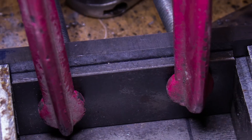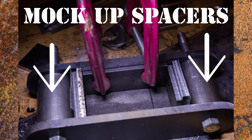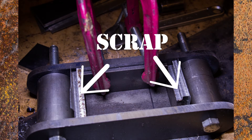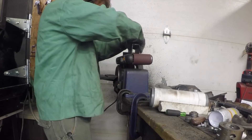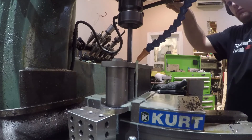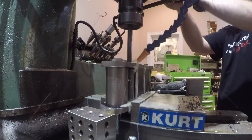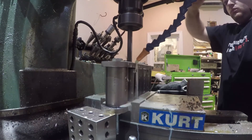I place the shackle sides on the mock-up spacer and bolt them together. I then place the sides of the spacer in between the shackle sides using clamps to hold them in place. I then jam some scrap steel into the ends of the spacer to align it to the center of the shackle. I then tack and weld the spacer together and grind the weld smooth. I put the spacer back into the shackle, jam the steel back into the ends, throw the assembly into my mill, and drill two holes that will clamp everything together. You can use the same technique with a drill — just do one side at a time.